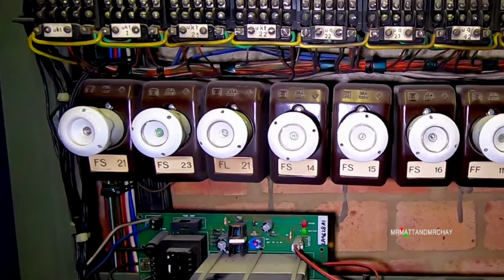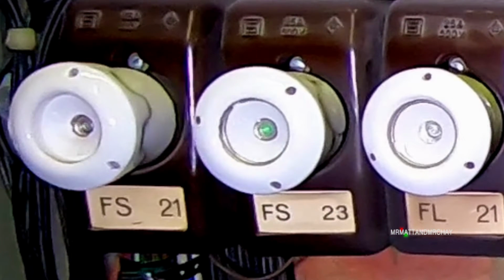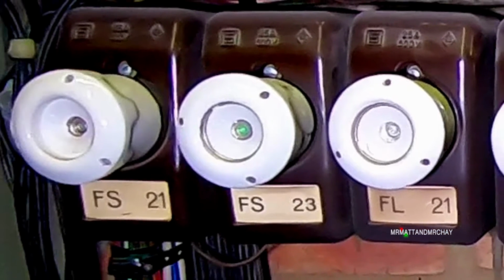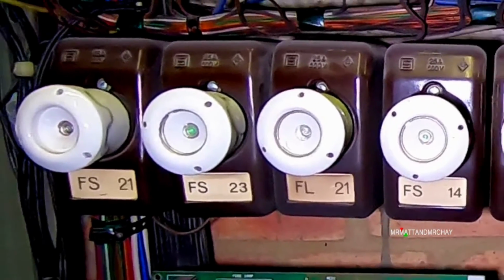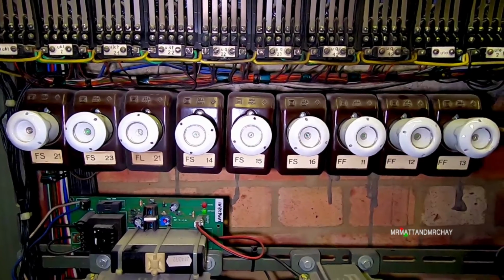Inside the cap, the fuse wire keeps this plastic indicator pressed against the front, so you can see if it has blown or not. Should the fuse blow, the plastic indicator cap is released and would ping into the fuse cap and would have to be placed back into position before the fuse wire is replaced.